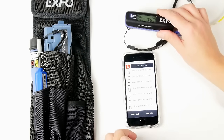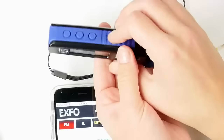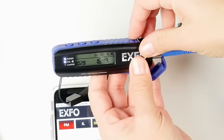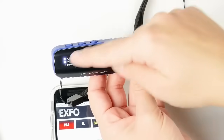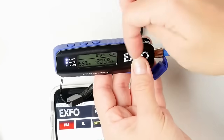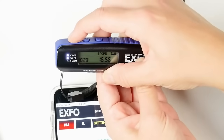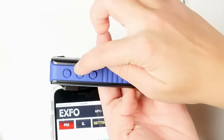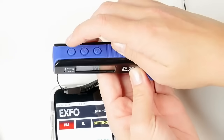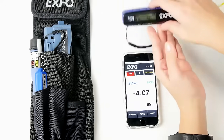You can go back to the result view in live mode. You can also view results directly on the power checker by holding the save button for over two seconds — you're now in save view. You'll see the wavelength alternate with the time and date at one-second intervals. To scan through previous results, press the save button to go back, or press the Wavelength button to move forward. To return to test mode, hold the save button for over two seconds.